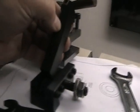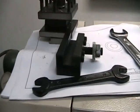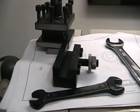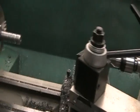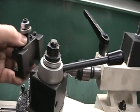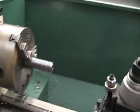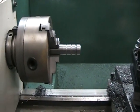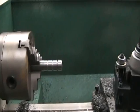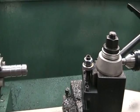With respect to these quick change posts — I don't know if you can see that very well — it's actually a little bit too wide, so I'm going to take that into my mill and cut it open a little bit wider. The problem I was running into is I wanted a little more flexibility with these tools, getting the center line adjustment where I wanted it. Now I need to get these parts fitting so I can do my parting and cutting with high-speed bit changes for parts I'm making for a MechMate CNC wood router.